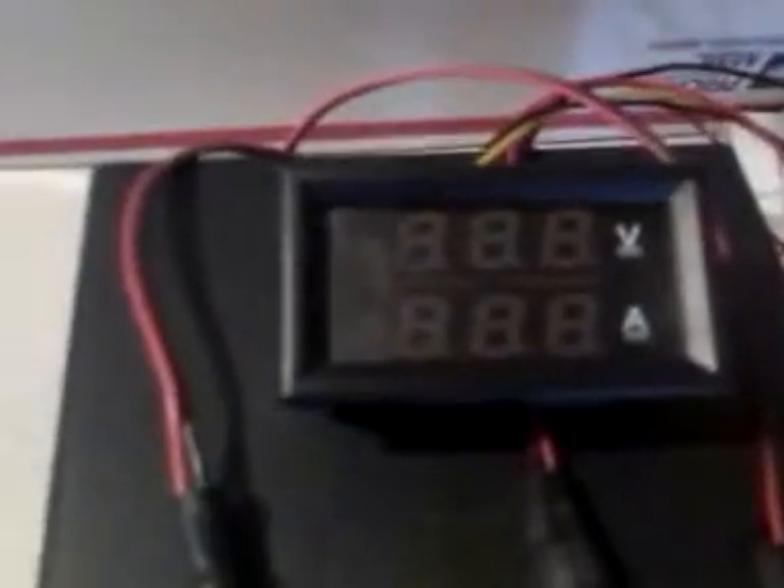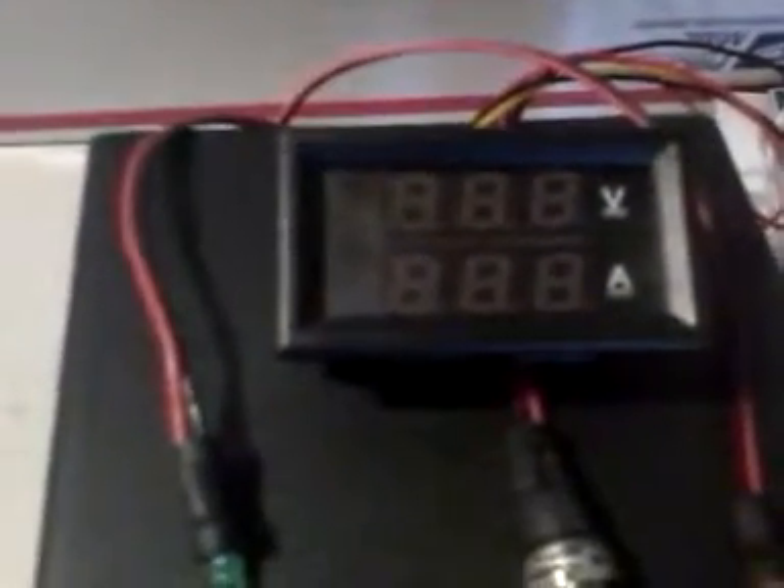And then on the box itself, I'm going to use a volt amp meter that lights up red for volts and blue for amps. And then underneath of that, I'm going to have the green light for the solar on. The red button in the middle controls the length of my diversion — I can set it for a long time if I want, to run five minutes. And then the red light lets me know my diversion's on.